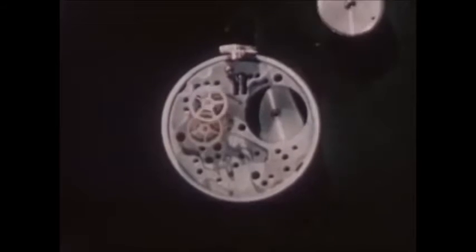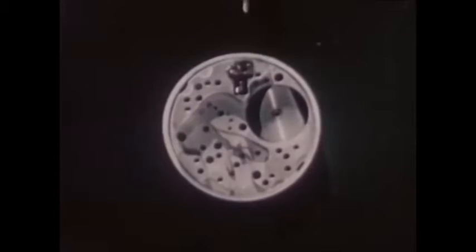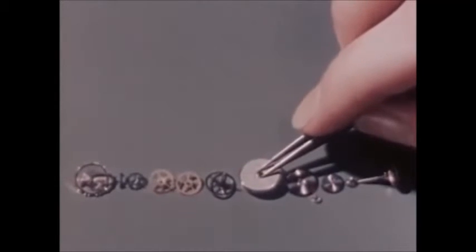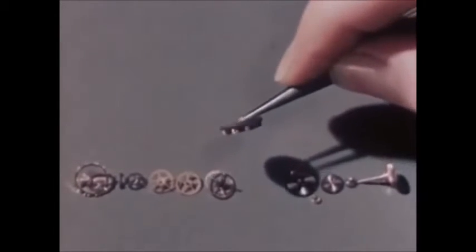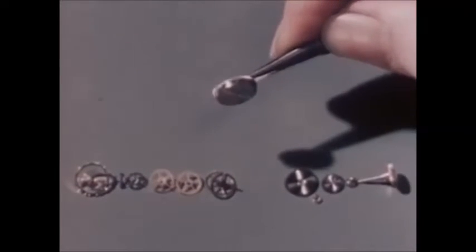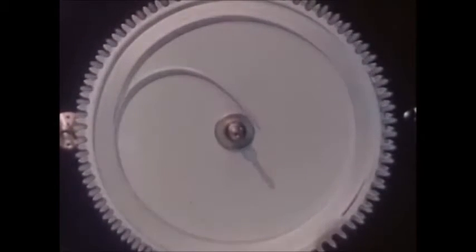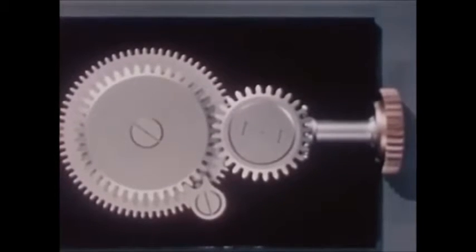Now let's see what these four elements are like in our watch. We'll take our watch apart. We'll begin with this part — the mainspring and barrel assembly. To see everything that goes on inside, let's use giant parts to make a watch model. This is the mainspring, and it lives inside the mainspring barrel. The mainspring is the power plant of the watch — the source of power, like the faucet in our water clock.